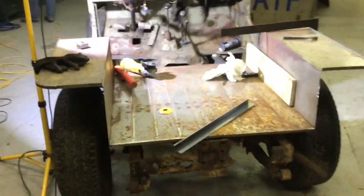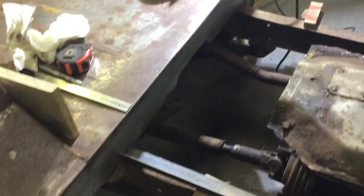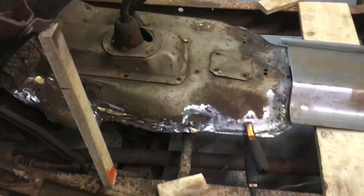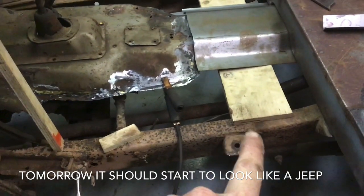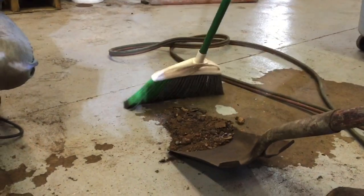We've made all the modifications, and we have the tub now bolted down to the frame. And then on the front here, we actually have it sitting on the mounts. And we put some clamps on it to hold it in place there. Made a little filler piece for there. We're going to tack it in and then start to adjust everything to kind of come together. We've got 3/4 inches of plywood under it to basically simulate the hat channel that would be under it.